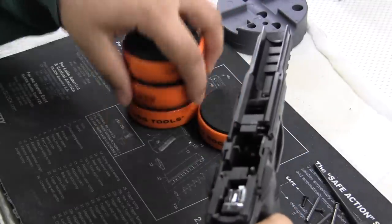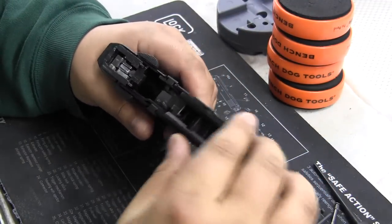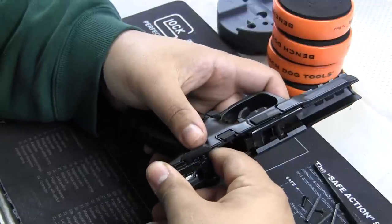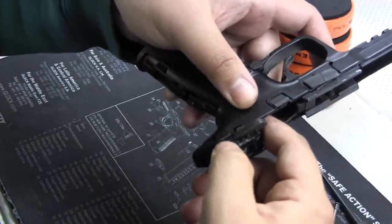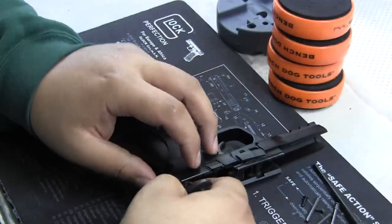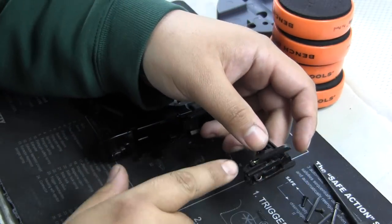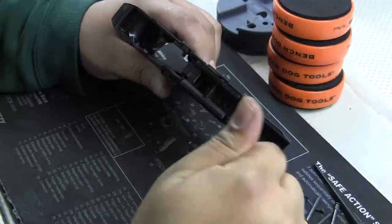From here I don't think we need any more tools except to take the hammer apart, so we'll go over that. One thing you want to be careful of is the rear hammer assembly — there are two springs on here that you need to be careful with. Try to cup it or make sure you're prepared to capture them if they try to pop out — don't lose them. Here's the first spring — you guys see it? The second spring is right here, already trying to pop out. I'm going to grab it and pull it out so I don't lose it.